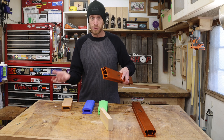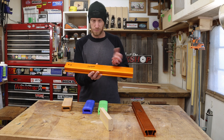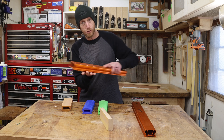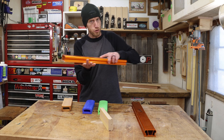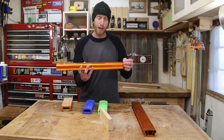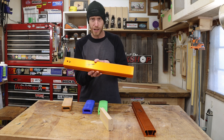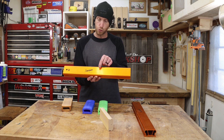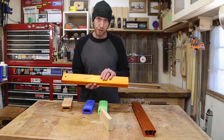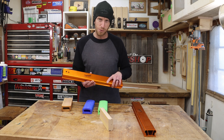You can get these from some of the other manufacturers who make longer blocks as well, but I think these are my favorite because they just look awesome compared to some of the other ones. So I will begin my process using a long block and relatively short sanding strokes, so I can try to sand everything as even and as accurately as possible — this helps get the initial radius established. If you want to check out Skyscraper Guitars, I'm going to put a link down below in the description. I'm not affiliated and I don't get any kickback, but I personally know Greg and I really believe in his products.